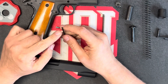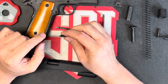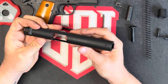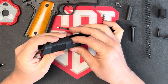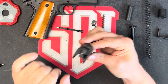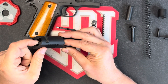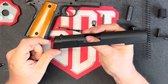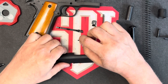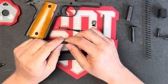The critical dimensions for the firing pin are that the pin protrudes from the rear of the slide, which is crucial. When the firearm is assembled, the firing pin comes through and interacts with the primer. In the back, it protrudes through the firing pin stop plate, and that back part is actually what the hammer hits when it comes down — it hits the back part of the firing pin directly. So your critical dimensions are how much this protrudes into the chamber area where it interacts with the primer, as well as how much it protrudes out where the hammer is going to hit it.